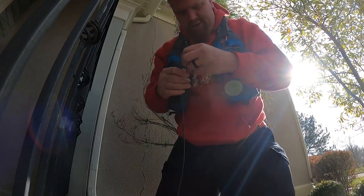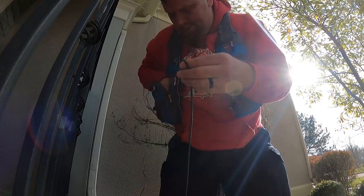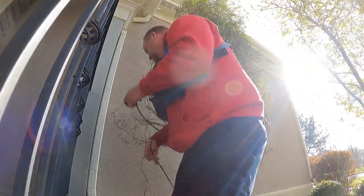We're going to use a male — when this is unplugged, that means it's dead, and that's what we want. We don't want hot power to this when it's unplugged. How you make your connection: you just stick it in there, slide it over, push it down, and slide the cap on. Sometimes when it's cold it's hard to slide the cap on — you can use your cutters to help slide it on. Be careful because sometimes you will cut your hand. Once we get that, we run it where we want the wire to go.